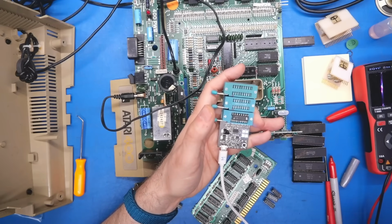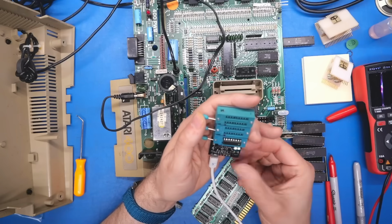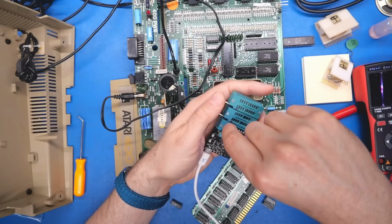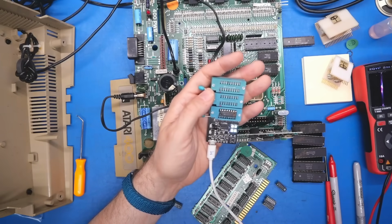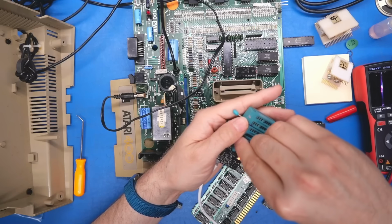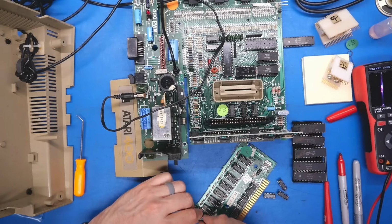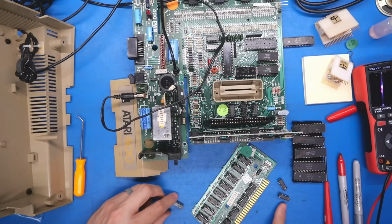We'll just run it one more time. No. Now it just came back with 2. And this could easily be some kind of a fault with this RAM tester though. Well, so far this third chip definitely shows up as red. That's totally bad, red. So this one seems like it's bad, and it's probably making a mistake about these others. So we're gonna pop these back in, except for the bad one, the one that's testing with the red lights.